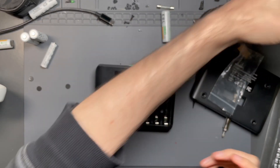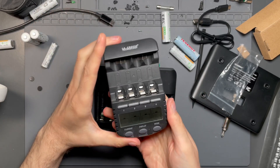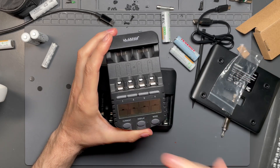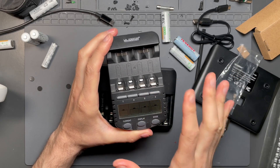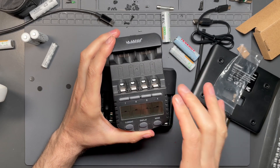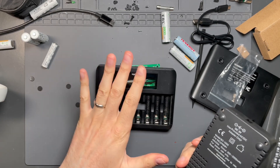That said, this is charging at 500 milliamps for AA or 250 milliamps for AAA. It isn't really that fast, so I wouldn't expect any significant buildup of heat. When I've used this, even with cells at very low voltages, that hasn't been a concern. Compared to chargers like the La Crosse Technology BC-1000, which can charge at 1.5 or 1.8 amps and where you'd want temperature monitoring, this runs at much lower current — so it's less of an issue here.